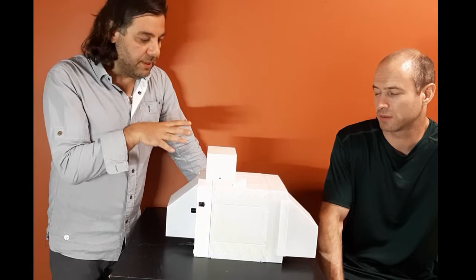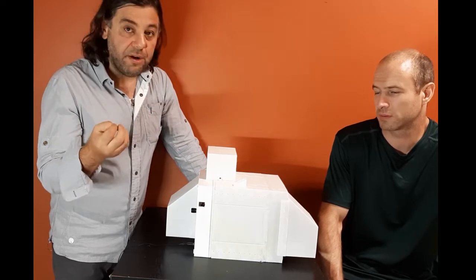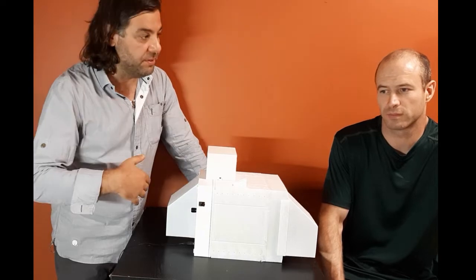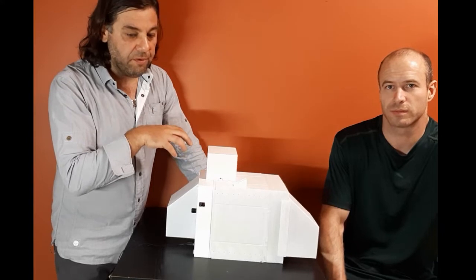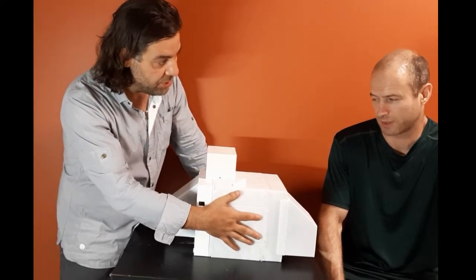So imagine that you are in your house and it's winter and you want some clean air from outside. What you normally think is opening the window, but what happens is that the hot air from inside is gonna flow out, and you've got to get cold air from outside, right? So if you wanna save energy on heating, that's what the device is doing. It takes your hot air from the inside to shoot it outside, but before that, it hits the cold air that comes from outside. So there's an energy transfer: the energy from the hot air goes into the air that comes from outside. And that happens inside this machine, the air exchanger.